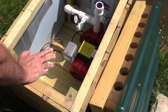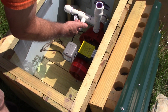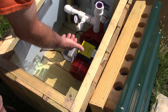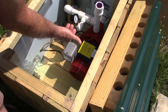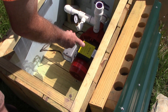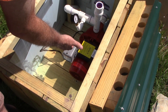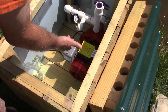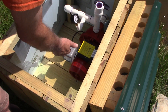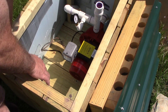Like I said, I can demonstrate it for you. You just hold this up until the pressure gets above 20 PSI and then it will continue to run on its own. It'll run all the way up to 60 PSI and then cut off. Then you can use that water until you get down to 40 PSI and it'll come back on and continue to do that. Now if you have some kind of failure where you lose your prime and your pressure drops below 20, this will cut out again and you'll have to hold the button up again until you get to 20 PSI.